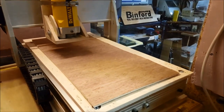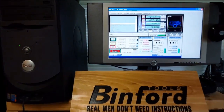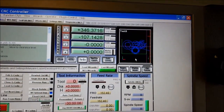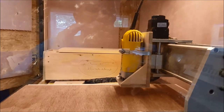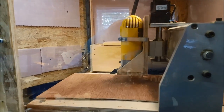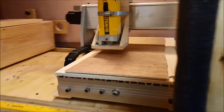We need to set this up and see what we have. What I always do before cutting anything is to manually move the CNC around my cut and make sure that it clears the wood and we don't have any crashes off the side — just a dry run with the keys to make sure everything fits. I don't have any e-stops or any emergency limiters on here, so this way we can make sure that it's all on there and nothing crunches.